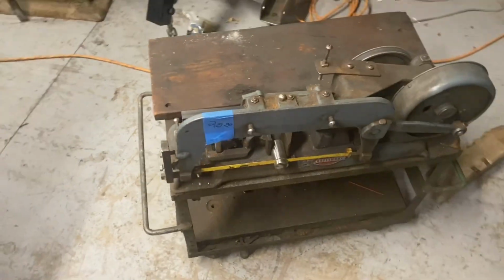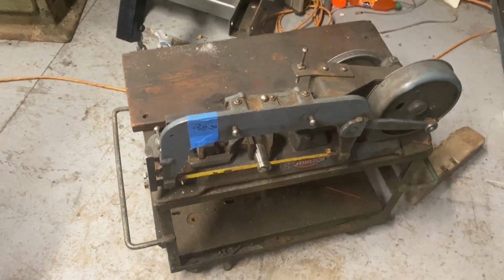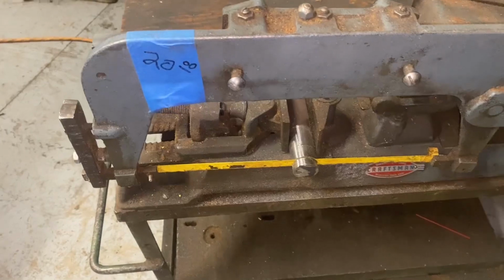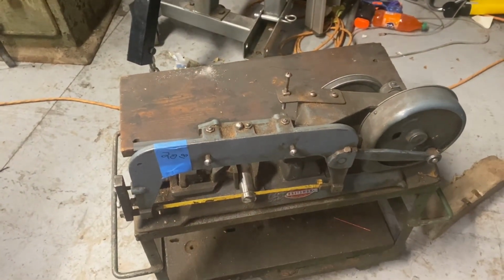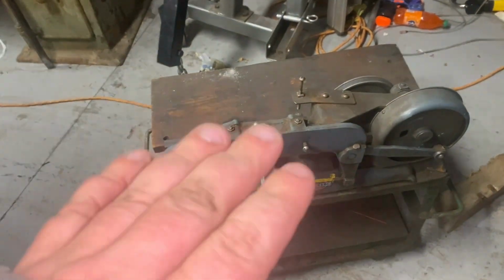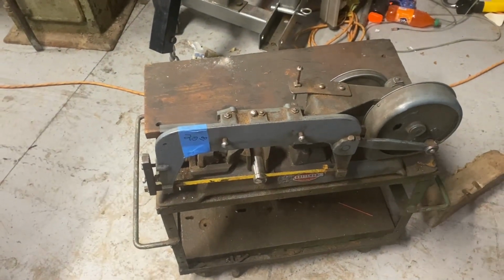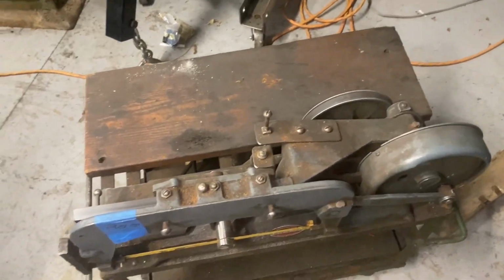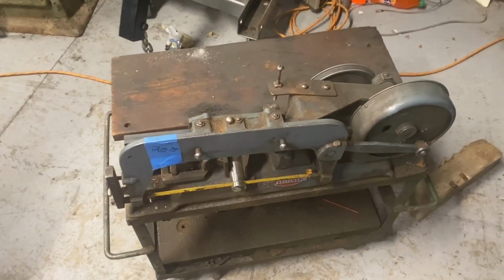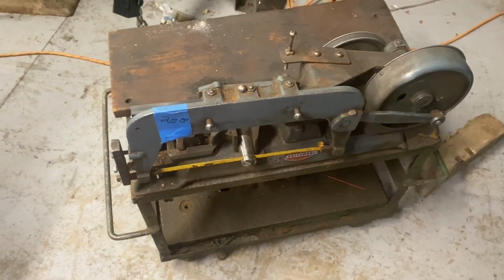As I'm nearing the completion of the shop overhaul, I'm down to the part where I have to find stuff for all the little things. Now, there's that Craftsman power hacksaw I got a month or two back. These things are surprisingly handy in the shop. I have a big Johnson bandsaw that I use to do all my cutting. But if you bring home a lot of shafting from the scrapyard and a lot of it's mystery metal, throwing it on this real quick and seeing if it will cut will save you bandsaw blades.